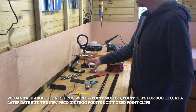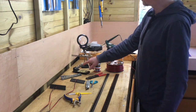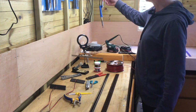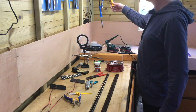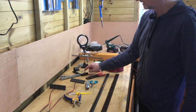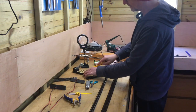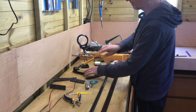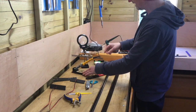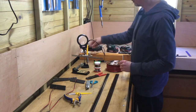And which way you want to go forward. And you want somewhere, when you've stopped using your iron, to put your iron back. It can either be in your helping hand, or if you're using electric soldering iron like this, or one of these battery operated ones, it's nice to have a base station like that with that foaming, where you can just wipe the end of your soldering iron as you're using it and put it back. Obviously, make sure your wire isn't in a place where you can knock it or it's going to be pulled like that. So I'll just go in there like that.